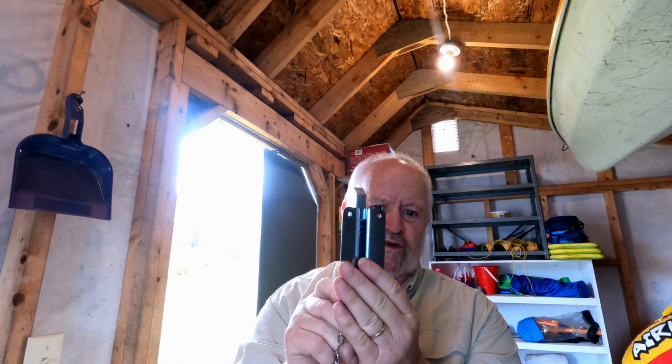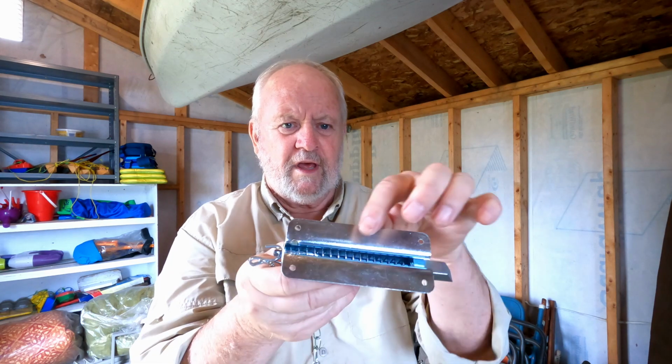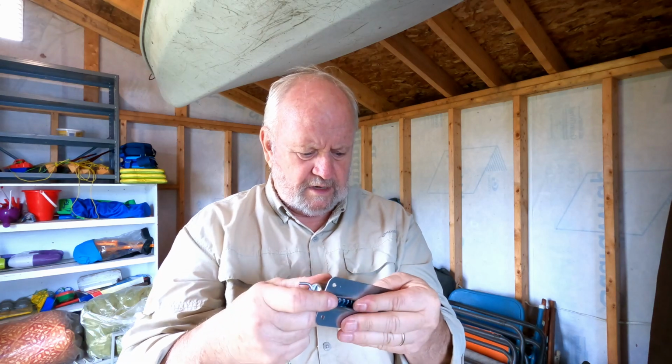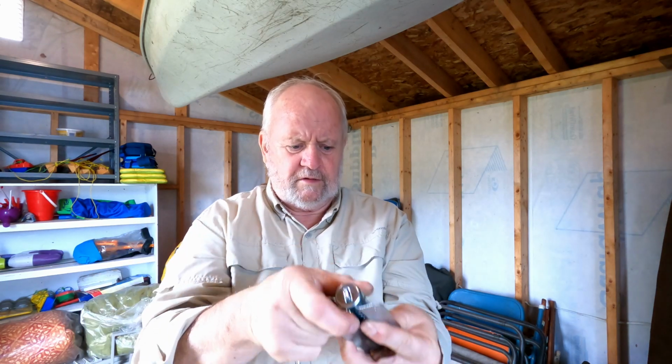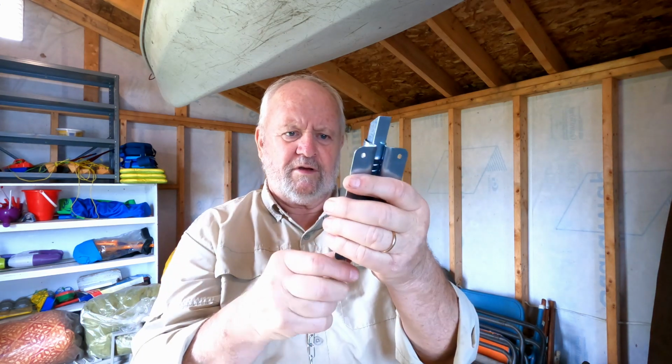Okay, so this deadbolt latch is set up to have a door close into the jamb, so that that stop that I just put up there would hit that angle, drive the bolt down and latch it in place. So because my door doesn't close that way, it closes the opposite way, I need to turn this around, and you can do that. At the bottom of that, there's just a little hook here that goes through the end of the deadbolt. The deadbolt has a spring inside it, if you can see that. So I had to push that deadbolt in, remove this hook, and then take the deadbolt out, turn it 180 degrees, push it back in, and put my hook in here. So yeah, that didn't turn out too bad.